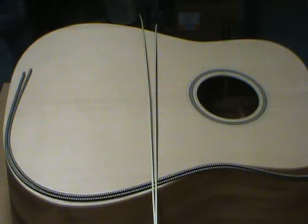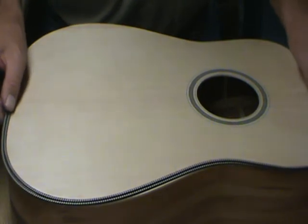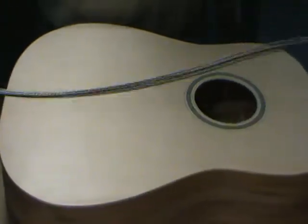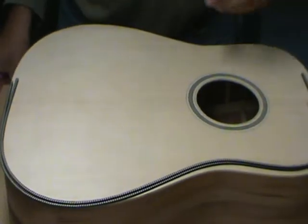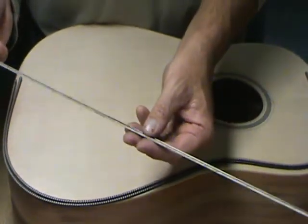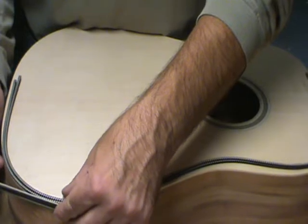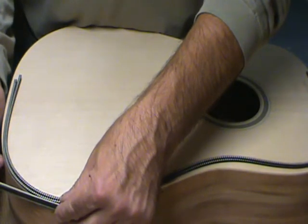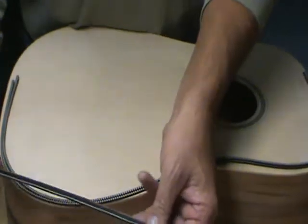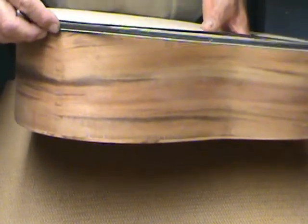All right, this is why I think it's going to be a little bit of time before this next video gets up. As I said, we're going to be binding this guitar. And I was looking at the design of my binding. I've got some herringbone purfling here that I'm going to use on the top. And that ebony that I just laminated, I'm going to put the white side up, so the binding will come up with the white side up. The herringbone purfling will be right against it. And then I've got that white stripe, so this will kind of be here, the white stripe on the bottom.